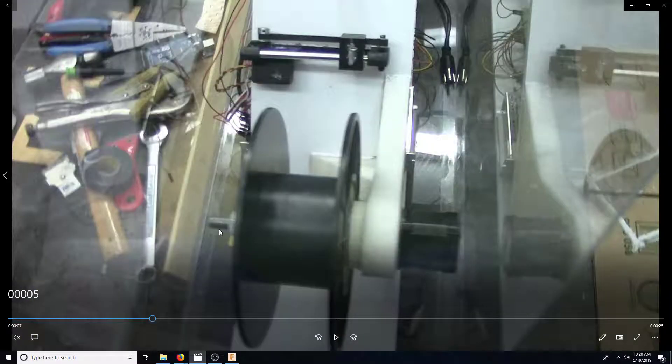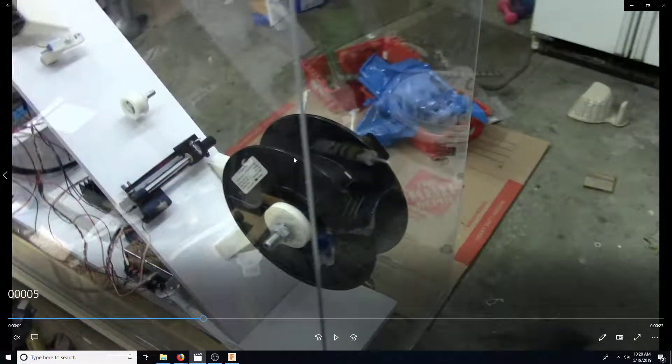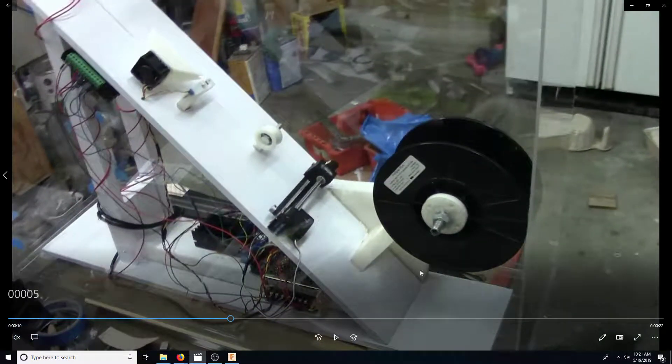We had a big problem with slipping because we didn't put any cork or anything on it. On the test stand, this is a through-hole and this rod is attached to the motor with a set screw. You can't tighten it too much or you'll pull the shaft right off the motor. There's such acceleration and impulse on this that it just slips — it starts going so fast that it's really hard to keep this tight. We should have increased friction on the spool by putting some cork on the back side of this pulley.